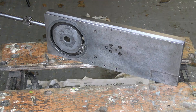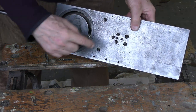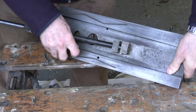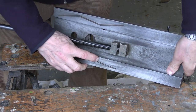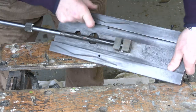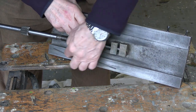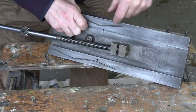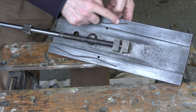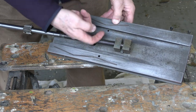One slightly odd thing about this cross slide is that it's got two oiling points — well, actually three. This one obviously oils the lead screw, no problem with that. It's got two oiling points here. If I turn it over, one comes out here and the other comes out there. This one actually oils not only this but also the dovetail, whereas that one oils the dovetail but not this slide — which is slightly odd. Would one not have put this slightly further this way?